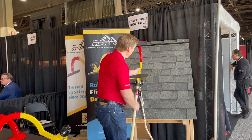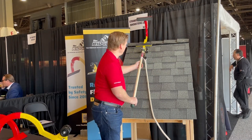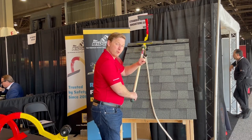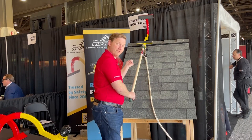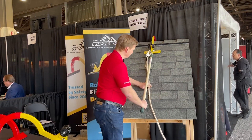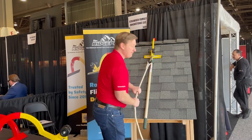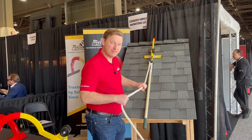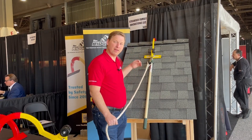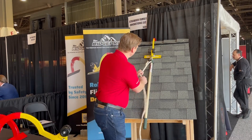I'm going to extend the RidgePro up. Once I reach the peak, that's when you would roll the pole, which would flip the RidgePro to clamp onto the peak — which we're rolling now. If I've set the pitch correctly — which I have — this is a 12-12 pitch roof and the RidgePro is set to a setting of 12. You'll see that it's perfectly clamped.